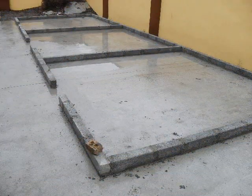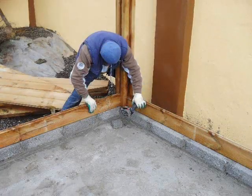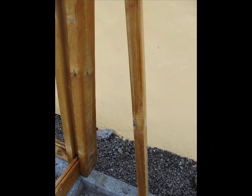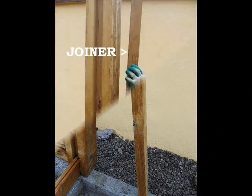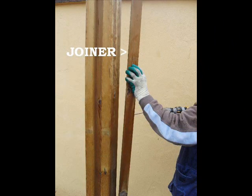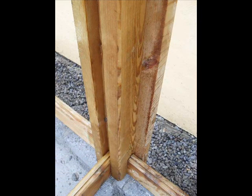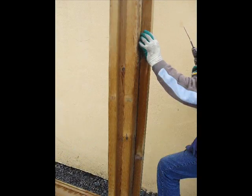Stable build. It is advisable to put a concrete block plinth under your stables. Please note that this is of extreme importance to keep posts level at all times. Always work from left to right when assembling more than one stable. Joiners are to be attached to the outer right post adjoining the following stable, as you can see from this picture sequence. This is a block of 3 stables.